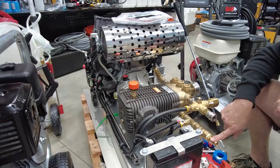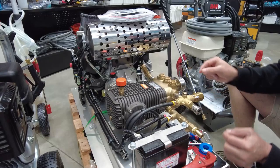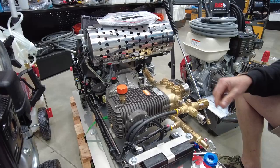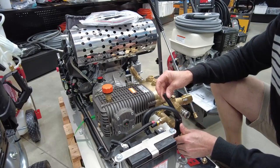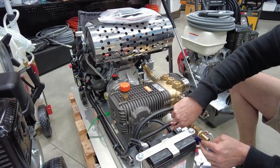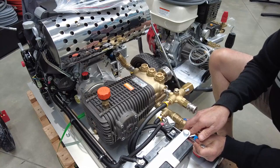This one is going into a trailer system shortly. We have our water in and our unloader valve here. I'll direct you back to the correct fittings — whether quarter inch or three-eighths — on our website in relation to the modification. What we're going to do on this particular system is cut this hose here, and we can keep the threaded section for reinserting and turning that back to a connection where it can go through the floor or back to a garden hose connection to route that away or back to a water tank. We'll just remove this particular fitting — these are liquid-thread sealed.